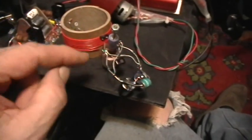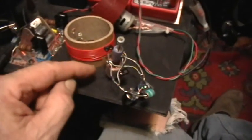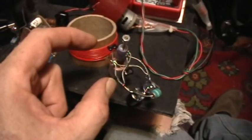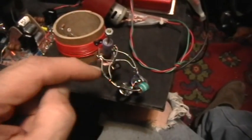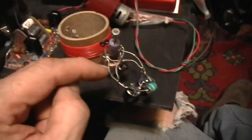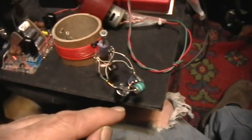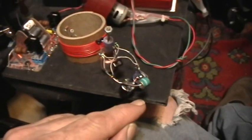There's the loop stick with the core tuned to about 5 millihenries. There are two 30 picofarad high voltage mica capacitors. There's a full wave bridge made out of ultra-fast 4007 rectifiers. There's a capacitor stack made of two 22 microfarad 250 volt caps in series.